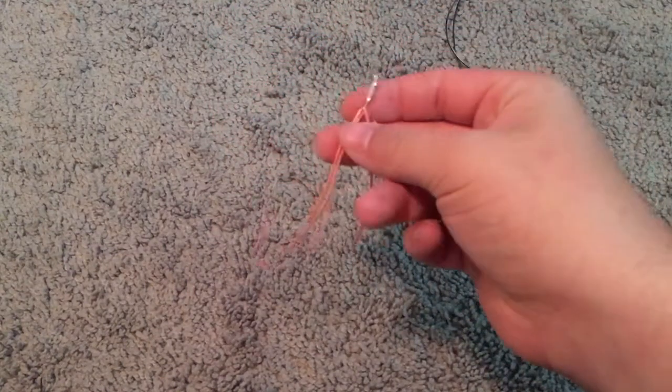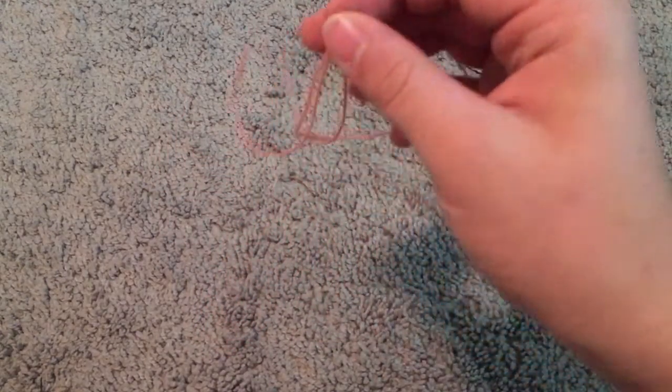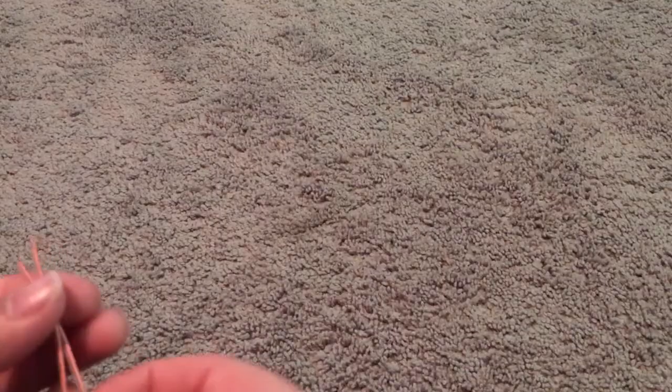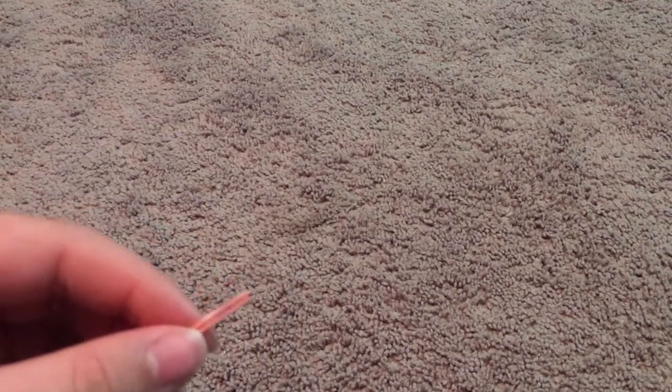That's basically all you have to do. Slide the part in and you're finished with the fans. Now let's go on to the heating cartridge. Basically these are the heater cartridge wires — what you're going to want to do for these is basically just strip them. This is the end of the wires that will be connecting inside of the Tornado.